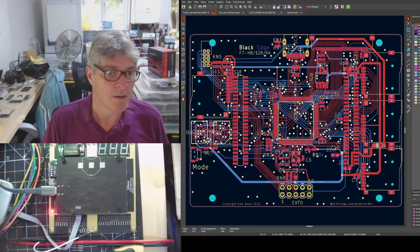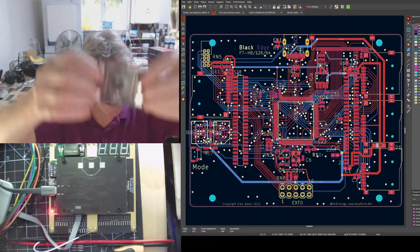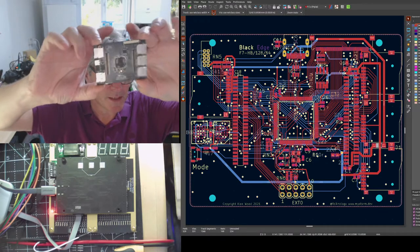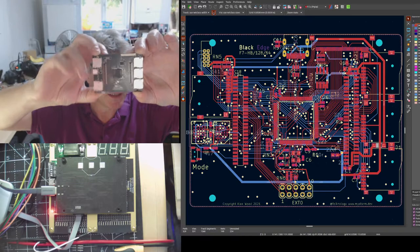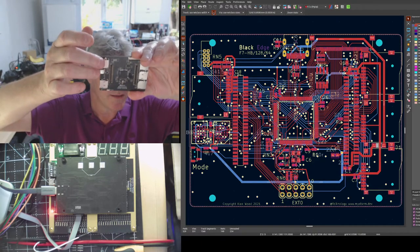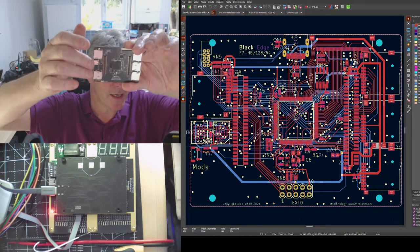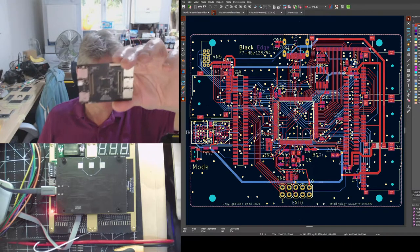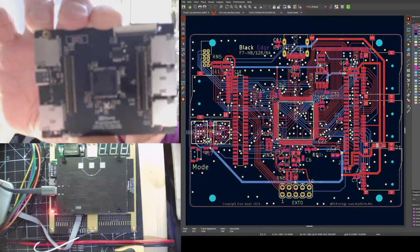And then on the very top, what you can see the back of here, connected via these BlackEdge NXT connectors, is the kind of BlackEdge board, if you like. And this has the microcontroller on it, so this is the system controller. In this case, it also has some blades on it. There's another blade there on this one. Then there's a SD/MMC card, which is connected to the microcontroller, not the FPGA. USB is here, and then Hyper RAM here. Those are the main kind of features on here. So that's changed around a little. I'll give you a close-up of that so you can remember what that looks like from the previous iterations.